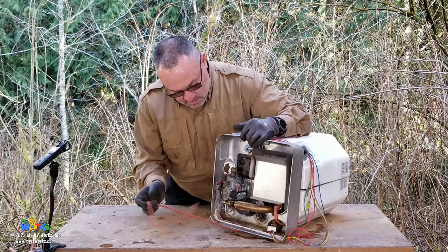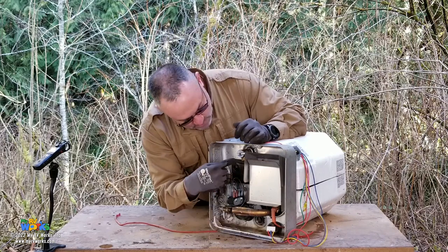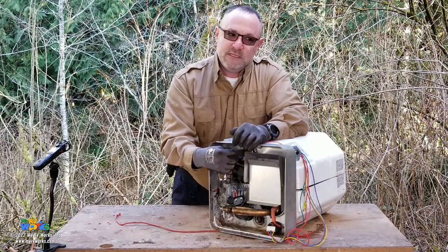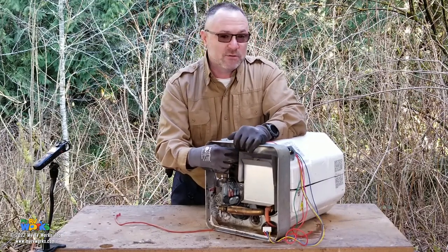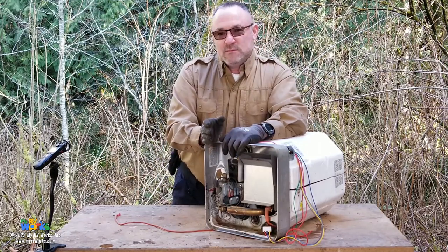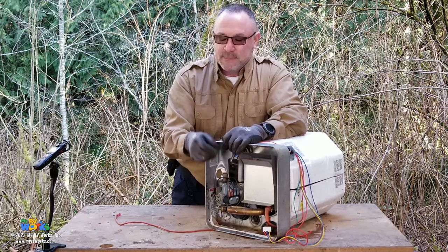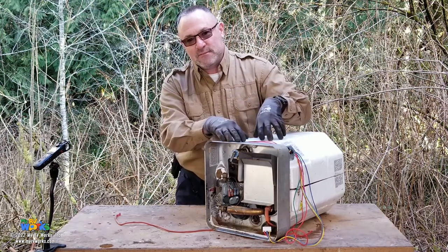We understand that. So water's going to fill our tank. We know that we have our fill port down below. This piece up here is a pop-off valve. If the water gets over 150 pounds of pressure or 210 degrees, then this thing is going to start weeping and leaking out. Occasional weep, occasional leaking, that's totally acceptable. That's not a problem if it does that. Inside of here, you have a pillow of air on the top of your tank.